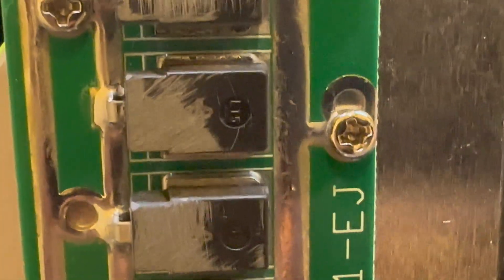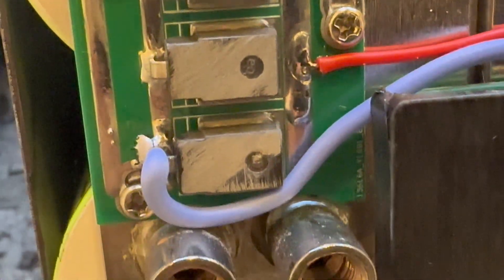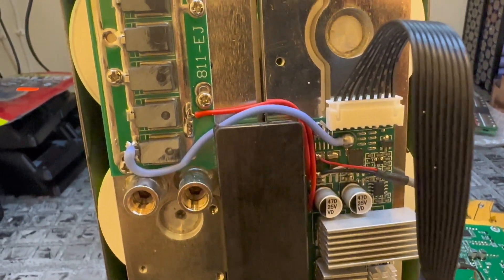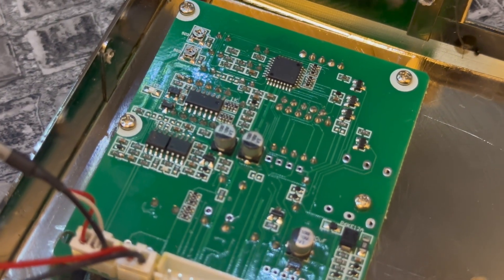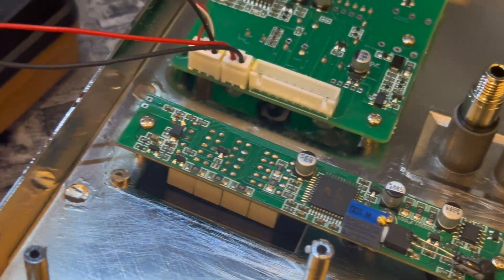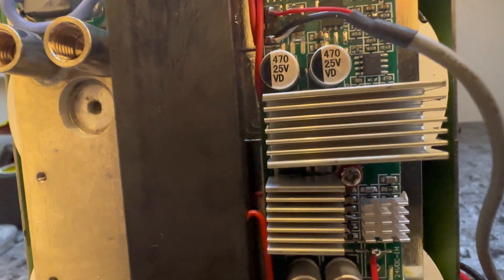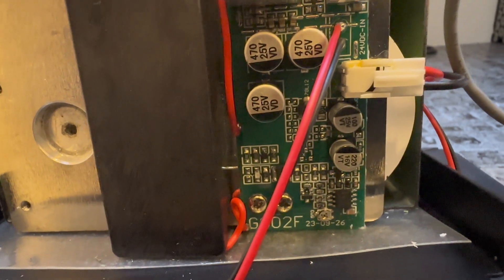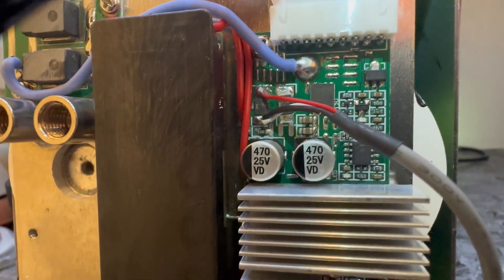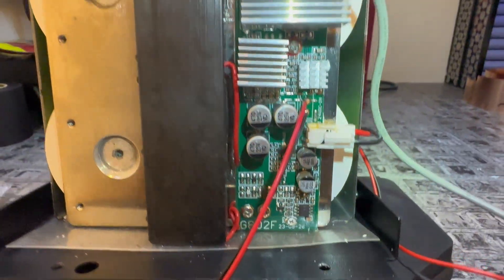When I first peeled this back I looked at these MOSFETs and thought it may have been these that had popped, but they'd been defaced so that was out of the question. I really didn't know what was going on with it, so I had a closer look at this motherboard. I can see no visible damage or burnt out areas on the board — no visible pop marks or anything on the capacitors, nothing on this side. There doesn't seem to be anything popped, and the MOSFETs seem to be in good condition.